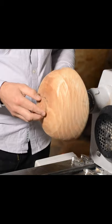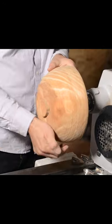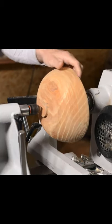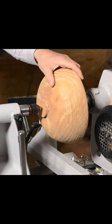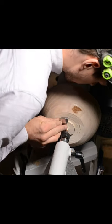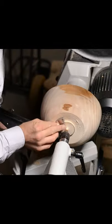As you get further down into the bowl the inside perimeter is less distorted, and therefore it fits my round jam chuck better than if it were set to the rim of the bowl. We're pinching the bowl up quite tight to make sure the bowl does not shift halfway through cutting the tenon. You want the faces of your jaws to lay flat and tight up against the shoulder of the tenon.